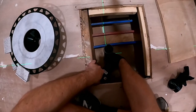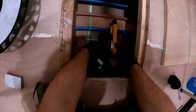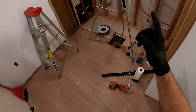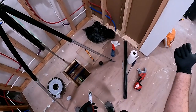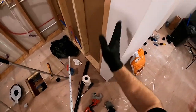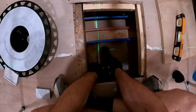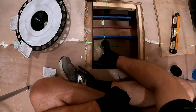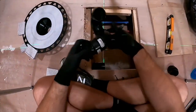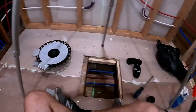There are two ways I could go with this: I could have it go a little bit further back, an inch closer to that wall. Ideally I want this to be... wow, sometimes I'm kind of okay at my job — that's basically exactly 48 inches. If I go that way an inch, then I have to trim an inch off of that to make it 47, and at that point I'd build it up to be flush out to here and still put my glass at 48. The other option is to tilt that in a bit more to get this dead center, and then I don't have to cut that piece. This gives me flexibility — I can leave more of this pipe exposed and if I don't love how it ends up, I can still cut it back.